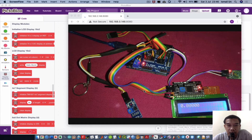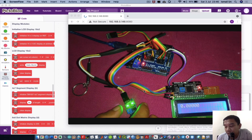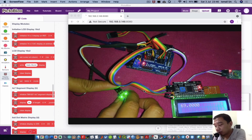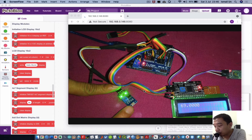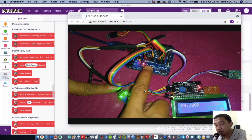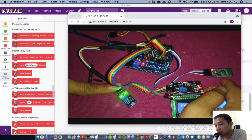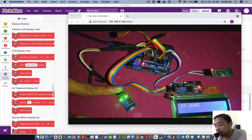Welcome back to Kajidata Online. In this video I'm going to explain and give you an example about how you can interface your Arduino Uno with a photo resistor sensor. It is attached with an LDR (light dependent resistor) and a small potentiometer that controls the sensitivity. There is also an LCD connected via I2C to the sensor shield Arduino Uno version 5, and an HC05 Bluetooth module.